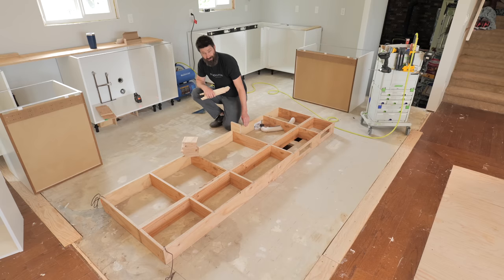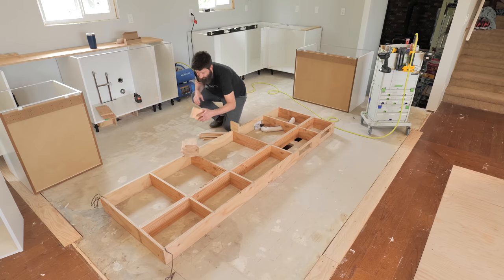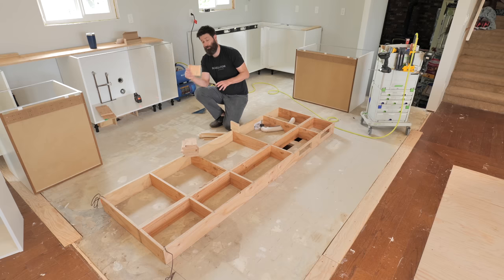When it comes to getting this thing nice and level up to the line all over the place, wood shims are going to be your best bet as a temporary way to get this thing sitting exactly where you want it — not a long-term solution though. What I like to do is take some plywood blocks and in a really crafty fashion you can get this thing rock solid. I'll show you that after we get this sitting level.